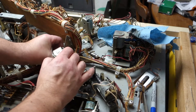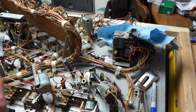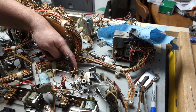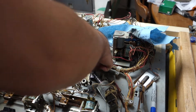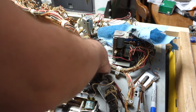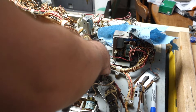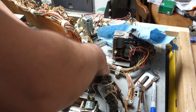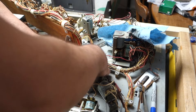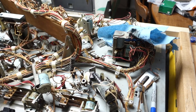We forgot to clean the switch. There's a switch down here, right here, and that's what gives you your points. We're going to go in there and pull up on it a little bit, because when the slingshot pulls up it hits the switch. By doing that we're creating a little tension on the switch, enough where both ends clean together.